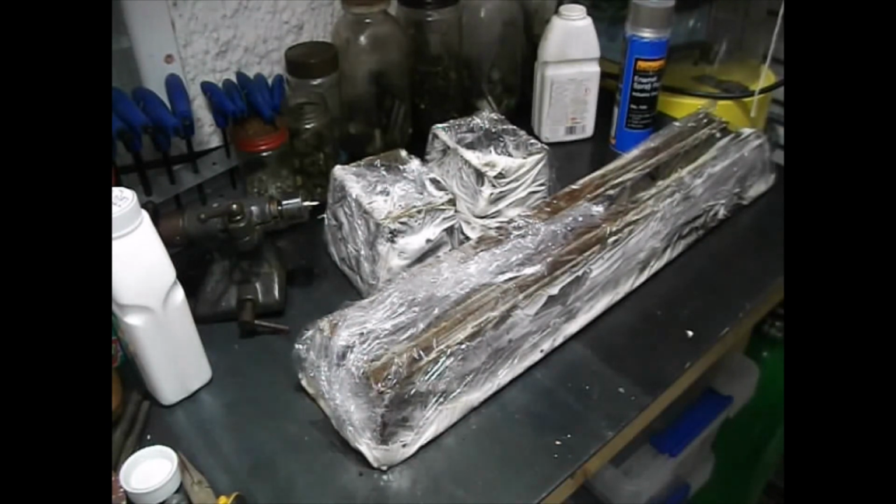It is Whitworth, that's now confirmed, which is good for me because I've got a full set of Whitworth taps and dies from my bike work. Yeah, 1/4 inch, 7/32 and 3/8 inch are the diameters of the bolts in this particular piece.